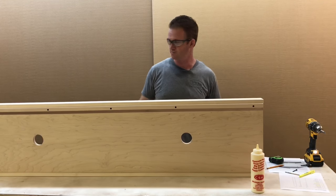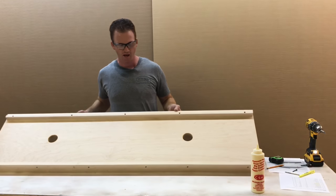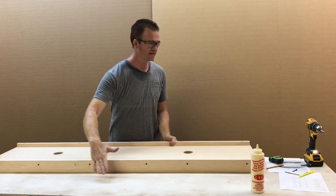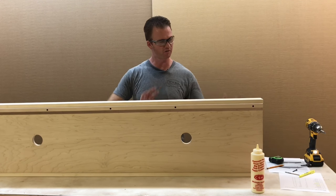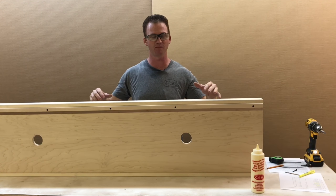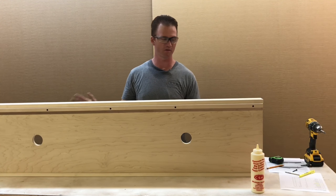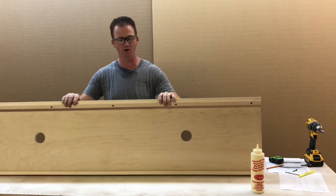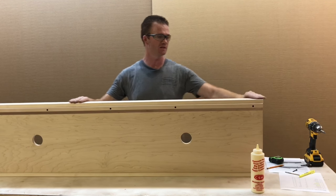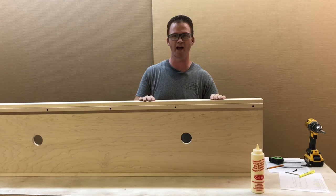Your header is finished. Some finishing tips: I like to take a scrap piece of wood and attach it to the back so it stands up easily, and when you put the finish on it you can finish it standing up on both sides at the same time. A lot of people won't finish the back, but in our shop we finish the top even though it's not normally seen. Another tip: if you're going to paint it, you can go ahead and putty the holes now.